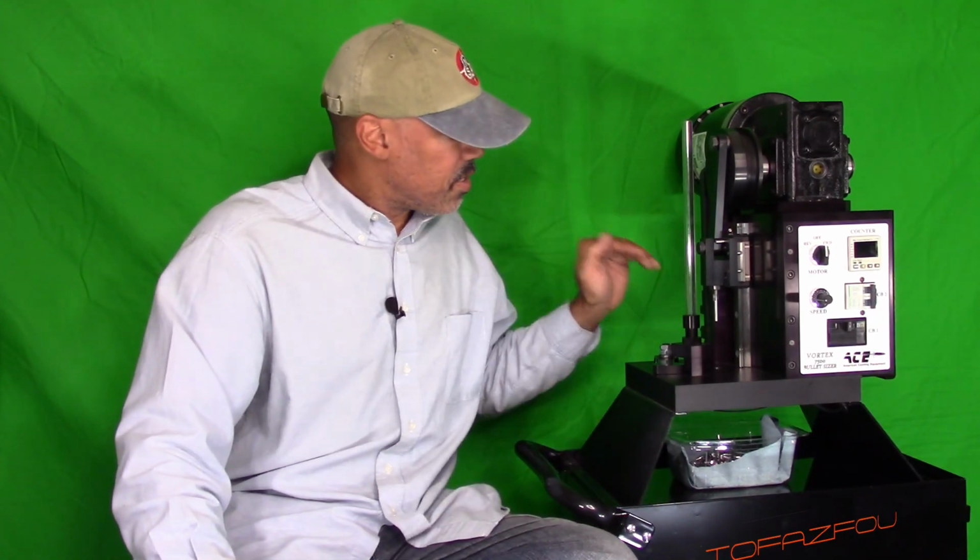And for you guys that are asking about lube, you do the same thing. Lube your bullets however you lube your bullets, whether you put a lube on them like Lee Alox and let it sit overnight, or you have some type of Teflon or whatever your magic bullet lube is, lube them the same way you do. Just feed them in the tube. Same thing, and then re-lube them again. For you guys that shoot muzzle loaders and powder burners, you're going to want to lube before and you probably want to lube after. This makes it so much faster, and that's the point.